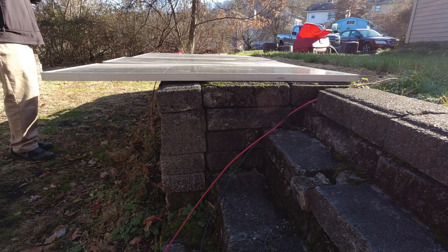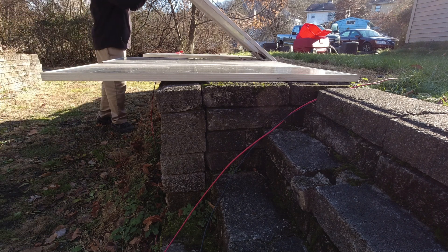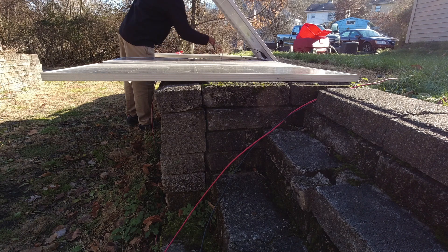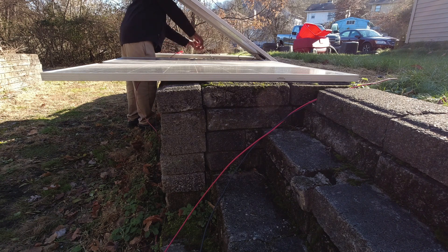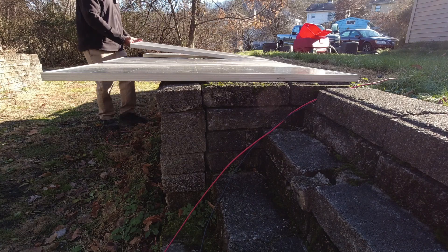I have never put this many panels in series — this is going to be a bit of a challenge. I just have to get in here and get these extensions off, which are pretty easily accessible. I am going to keep the original 10-gauge cable. In my last video I was talking about 12-gauge versus 10-gauge, but because of the distance I'm going to do 10-gauge. I don't think it matters, as we saw in the last video, but I'm going to do it anyway. Then I'll put my 12-gauge cable back on the panels it came from.